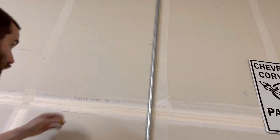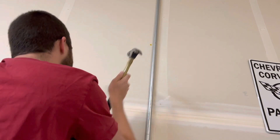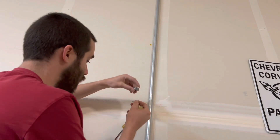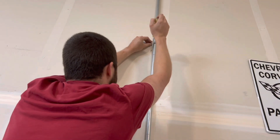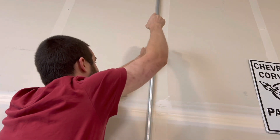Once you've got that, go ahead and take your little plastic anchor and hit that into the wall. Then take your strap and your screw and you are ready to go. I like to do these by hand because if you hit it with a drill and accidentally over-tighten it, you're done — your hole is stripped out and your pipe is not going to be sitting tight onto the wall. So I like to just do this by hand.